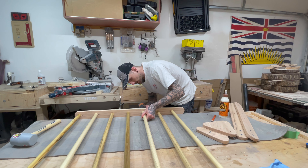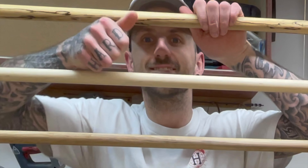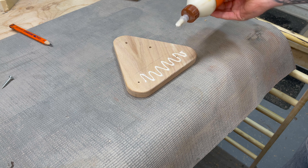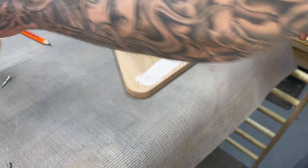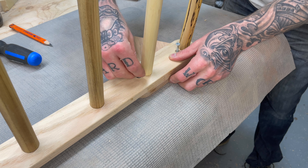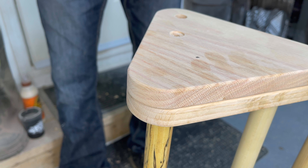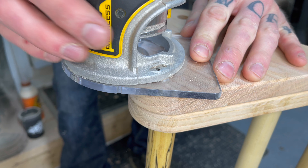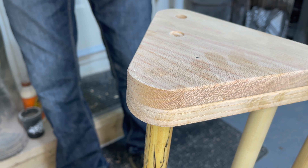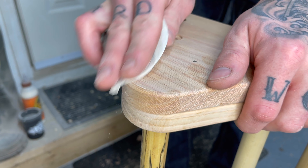I'm using two-inch number eight screws to install the dowel. Now that I've got both ladders put together, it's time to install the static side of the triangle. I use a little bit of glue and grab the longer ladder — the 36-inch side — and screw it in place. Then repeat on the other side. The triangle and ladder didn't quite match, so I grabbed my router with the flush cut bit and trimmed it to match. Then I swapped bits to the eighth-inch round-over and quickly softened the edge.